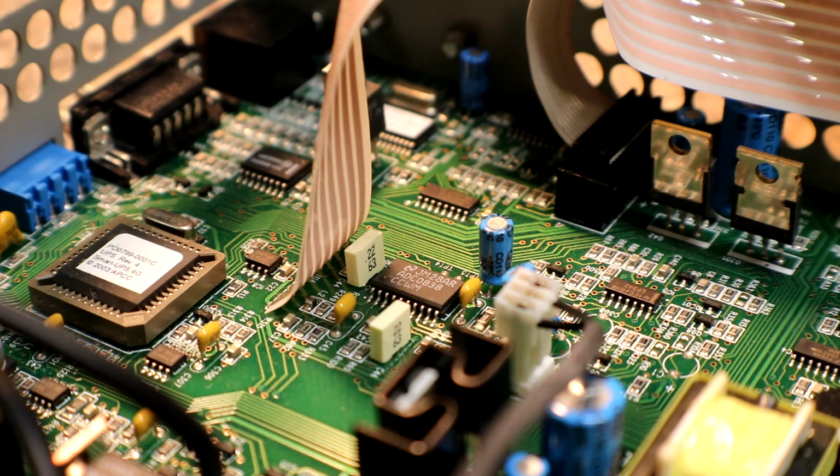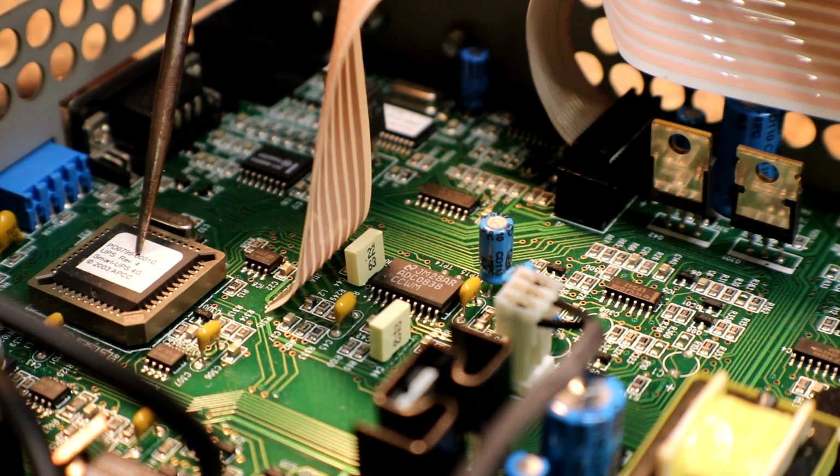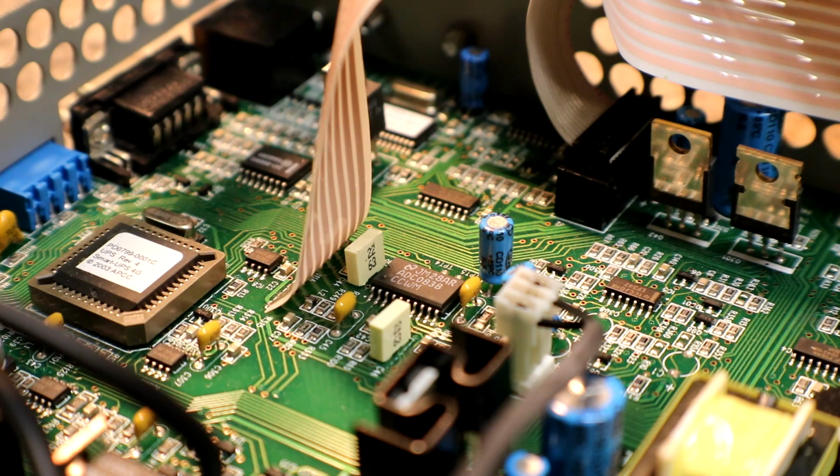I guess maybe I'll do just a little bit more research to find out if the boards are the same. I'm going to take a guess and say that they probably are, because it looks like it's using the exact same chip. And he also said that it was near this chip over here as well. So I'm pretty sure this chip is the correct one, and I would just have to take pin 2 over to 5 volts, I guess, to make the hack. But for the time being, I just want to make sure I can get everything working first. I do have some other UPSs that I might try it on first just to make sure it does work.